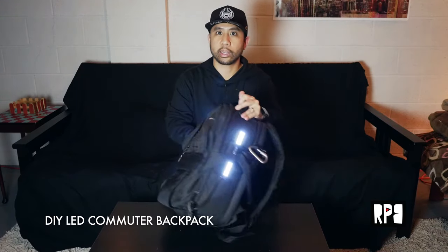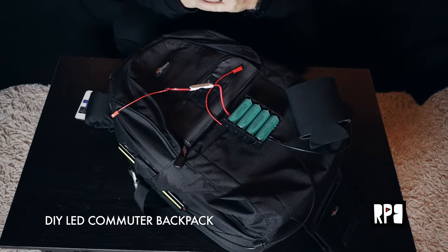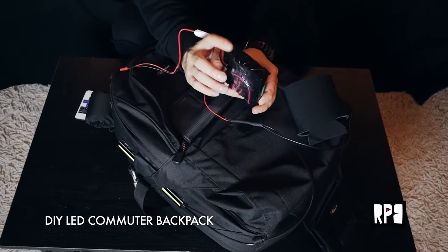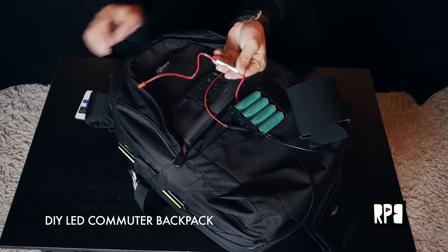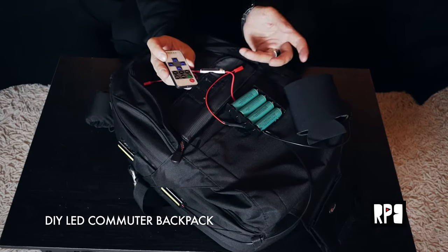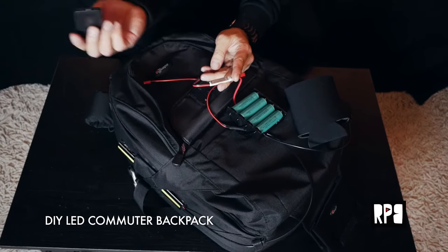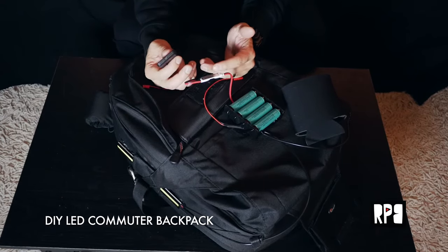So I'll show you guys how to assemble the battery pack. Basically I had a few 18650 cells lying around — four to be exact — and I bought a battery cradle which you could get on eBay for five dollars and just connected the batteries in series. From there I connected it to this LED controller, and this is how I can change the modes. I can turn it on and off wirelessly, which is great. I can keep this in the backpack and access all the modes remotely, and it actually works really well — it can read the signal just fine from within the front pocket from a pretty good distance away.